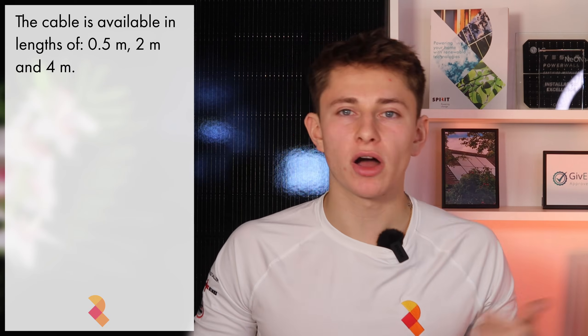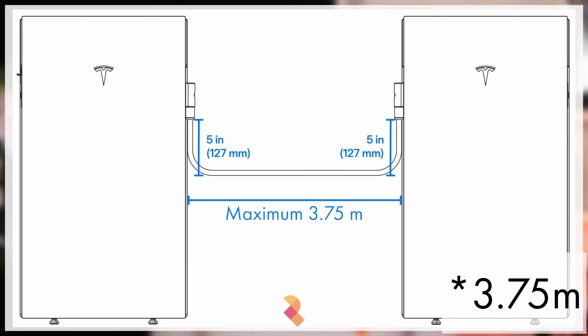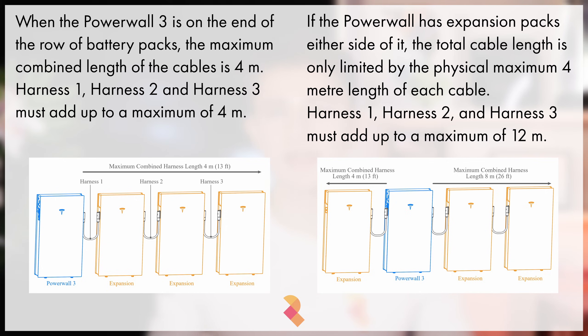If you do stack the batteries, you won't need to pay for the frosted glass pane that you'd buy if it was going to be mounted adjacent on the wall. To connect a Powerwall 3 to a DC expansion pack is very simple — Tesla have built all the connections into one cable. This cable comes in lengths of half a metre, two metres, and four metres. You can't link the DC connection cables together, so the maximum distance between batteries is about three and a half metres. If you're getting multiple expansion packs, they connect up with cable links either side. Once the batteries are connected up, it's very easy to set up — there is a simple stage in the installer's commissioning process where you select 'Add Expansion Pack' and it will do everything else for you.